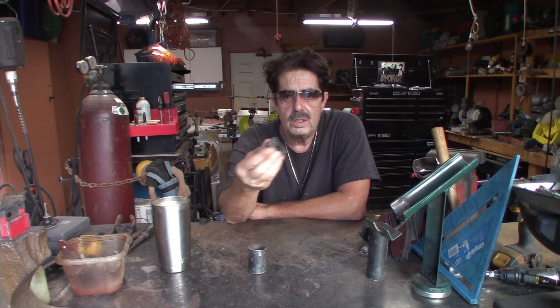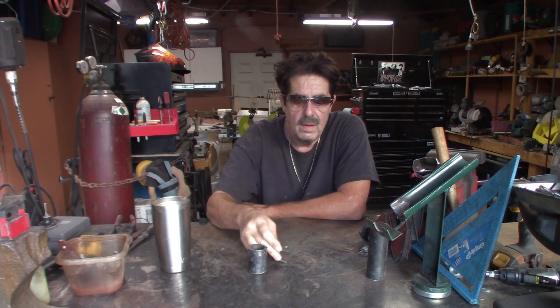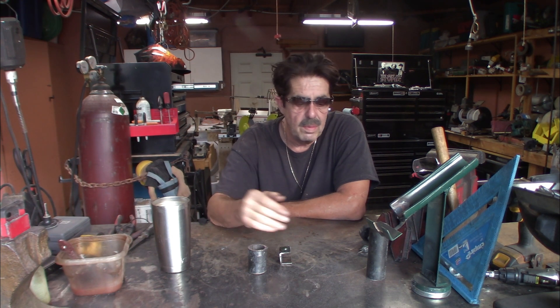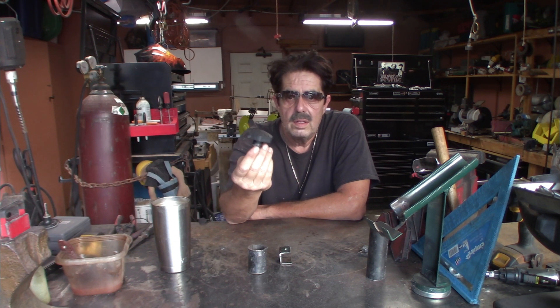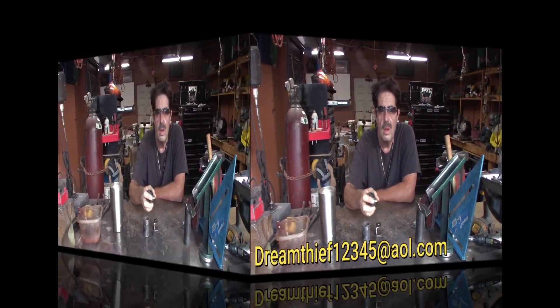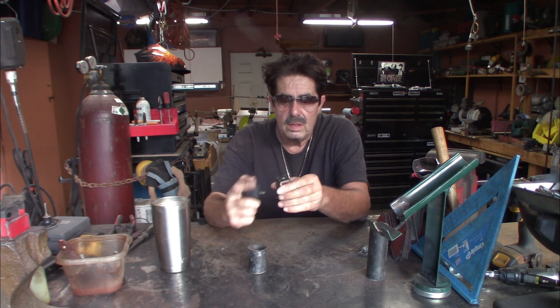He was going to trash it — I showed him a way to fix it, and I'll show you later in the video. Get a thick piece, then you're going to need a nut and a bolt. You can weld a piece of steel on top for a handle — I have a bunch of these plastic molded handles. I sell these as kits and ship them, so you can contact me. Back to this — I'm going to drill a hole in there so the bolt goes into it.